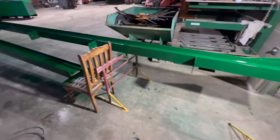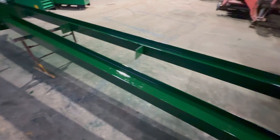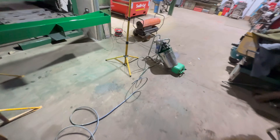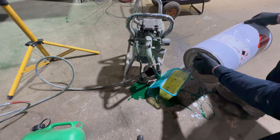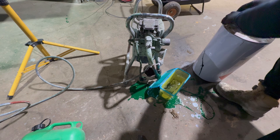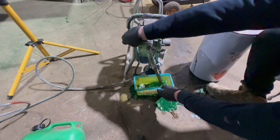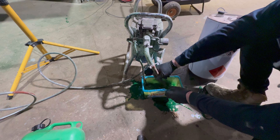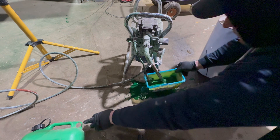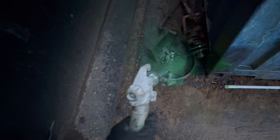You can see the quality of it — it's a lot better than putting it on with a paintbrush. I've got it all over my dad's chair, but yeah — now we've just got to clean the gun out. Didn't take very long, did it? Just going to empty the green paint out and put some thinners back through it. Load it up with paint thinners — put it on top of there to hold it and spray the rest outside. Turn the nozzle like that to spray all the green paint out so the thinners come through and it's cleaned out.